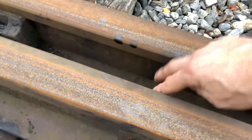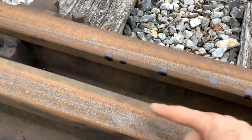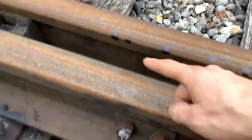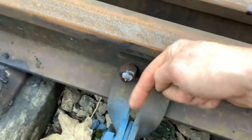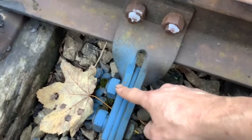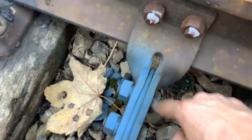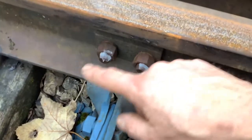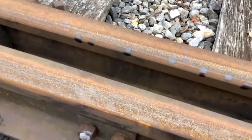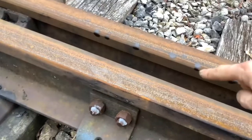With the stretcher you should have a minimum 50mm gap. Any less than that and as a train goes through it starts to kick the back of the switch, leaving wear marks. That kicking kicks on the shoes and the rods - something has to give: it either bends at the rod or starts to damage the bolts. These are the clear giveaways. When checking your rods and bolt tightness, look for split marks and crack marks. Maintaining your flangeway there is quite important. Drilling dimension charts are available telling you the gap opening dimensions so you can set, mark, and drill the rods.